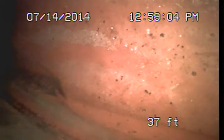We have reasonable clean out access here to be able to clean those roots where the cast iron meets the clay. So I'm not going to start suggesting installing clean outs at this point. It's something that can be handled down the road when that section gets replaced. But a section like that, certainly being older, there's no disadvantage to being proactive and upgrading it when feasible, instead of waiting for it to fail and potentially adversely affect the structure over a period of time. So you may want to discuss that with a qualified and reputable plumbing contractor, see what it would take to do something like that. But it's usually minimal. You're not talking about sewer replacements or anything like that.